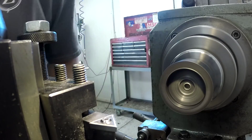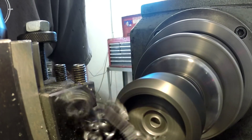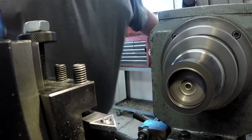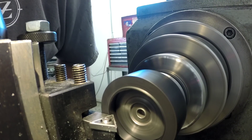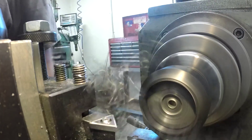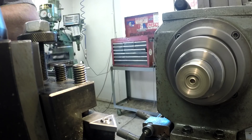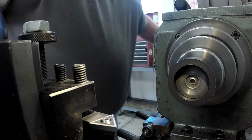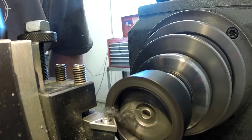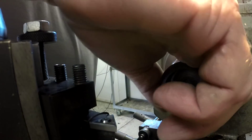Here we've got a triangular shaped tool — it's a 60-degree tool, but it's also oriented to the part at 45 degrees, so you can see it's doing a rough chamfer. Not all the way to depth, but I am cleaning up the face. I'm getting one clean face cut and then a rough chamfer. I'm not hitting any stops — we're just giving ourselves one reference surface so that when we flip, we can start using the stops. And here you can see how nasty that stuff is — it's just like rubber bands. Do not get tangled up in this stuff. If you get a bird's nest around the mandrel, shut the machine down and get it out of there. If you get caught in one of those rubber bands, it'll suck you in. We're using both sides of the triangular shaped tool to get just a face and a rough bevel.